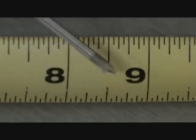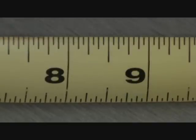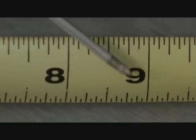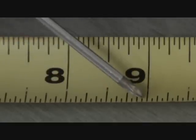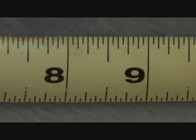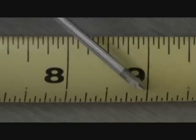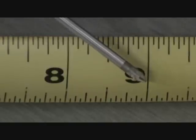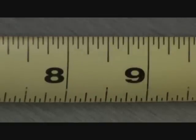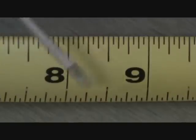And so that's how you read a tape measure. If you look just below the nine, you know that's fifteen-sixteenths. A lot of times, if I would be reading that and calling out a measurement, I would say eight and fifteen-sixteenths. Or I would say it's a short nine inches — any time I say 'a short,' that means fifteen-sixteenths. Or if I say a long nine inches, that would be nine and a sixteenth. It's just different ways how you want to read something.